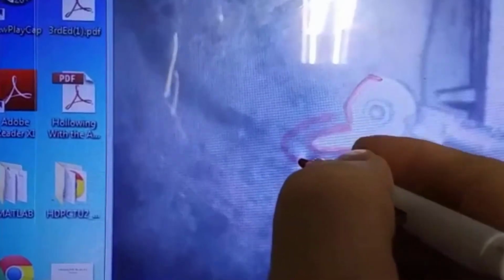All right, here I'm going to a different part of the hollow form. I'm adjusting the swivel tip. You can see here that this is the boring bar. Not that clear because the camera is not perfectly aligned, this is the shaft of the swivel tip. This is the swivel tip. So it's in that 45 degree orientation, which is a little bit more vibration prone, but necessary to get way off to the end. You see it better now. I swiveled that cutter more in order to get more of the top half of the hollow form.